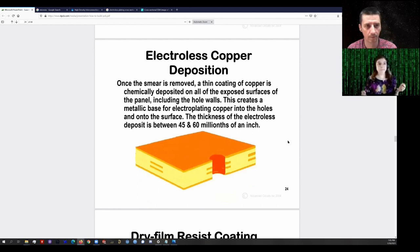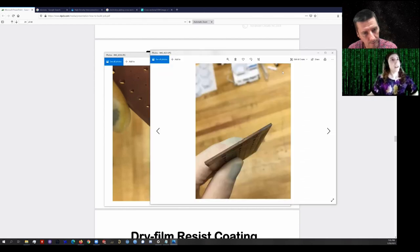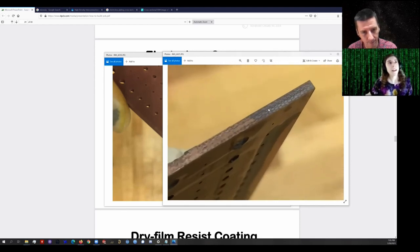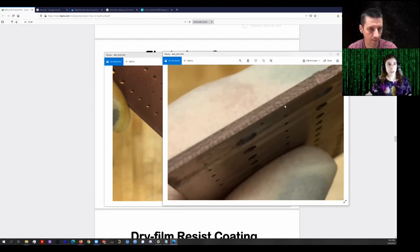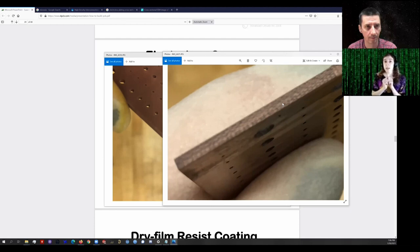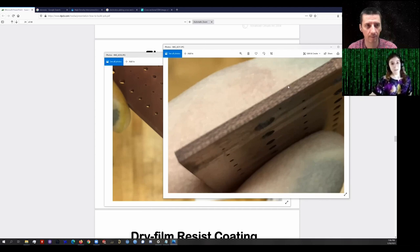The board actually turns a sort of — I do have a picture of it. Here is a board after electroless plating, and here's another one. The rack that held the board sat right on this edge, so you can see there's no copper plating here, but there is copper plating elsewhere. This is the very edge of my little tiny test coupon board. There's now copper electrically connecting both sides. If you touch a multimeter to both sides, you'll see resistance on the order of an ohm or less. After the silver step, you can't measure any appreciable conductivity from one side to the other — maybe tens of megaohms — but no appreciable electrical connection until the electroless copper step has had about 20 to 30 minutes to build up that 45 to 60 millionths of an inch of copper.